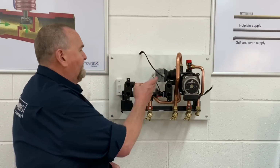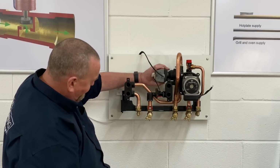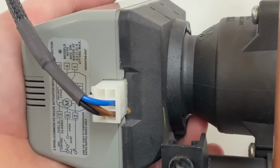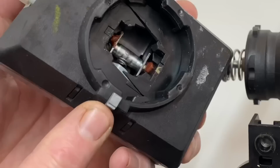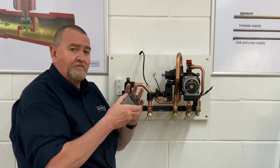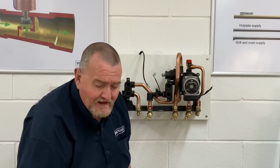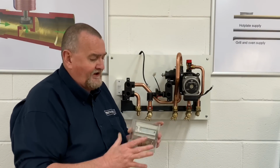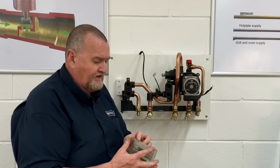So the diverter actually has a cartridge in it, and the head, literally, there's a little clicker underneath. It's a quarter of a turn, that pops out, and all we do is just unplug it. So that's the diverter motor. So you can replace the motor, the diverter cartridge. So we're going to pop that out. Now, a replacement cartridge, you normally pick those up and they come with a little key to remove them.